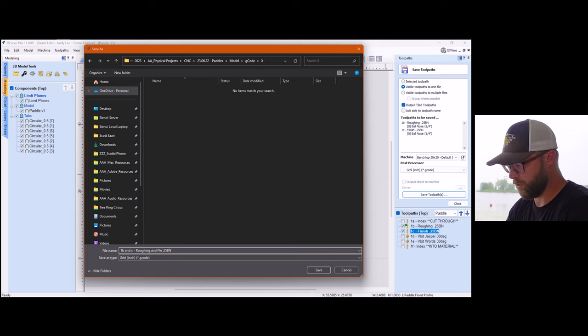We start off with our blank wasteboard. Just like cornhole, I used a quote unquote slide guide, aka piece of wood, to make sliding my project material easier. I made sure it was squared to my machine before screwing it down. The project material is placed against the slide guide and screwed into place. I drew reference lines on the slide guide and the wasteboard from the project material 0,0 to show the amount of slide needed. For this project, it was 24 inches from the project material 0,0.